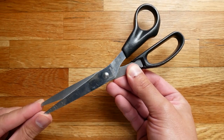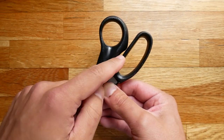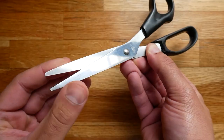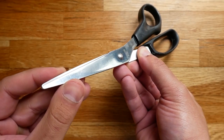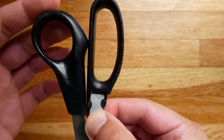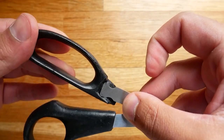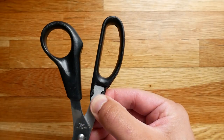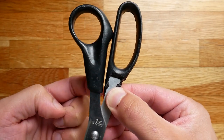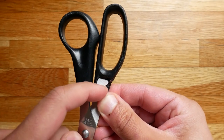When the scissors close, that's about as far as they need to go and they make contact in that little dimple there. But there is no contact here, so when they get here the scissors want to continue going. That means it forces this bit here to get in contact and basically stresses this joint. So what I'm including in my design is that when it contacts there, I'll make a contact point here as well so that it doesn't keep stressing this joint.